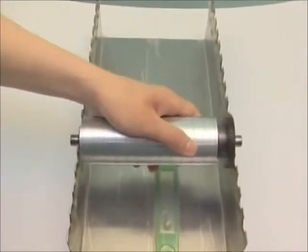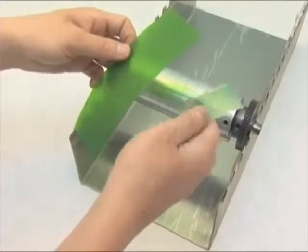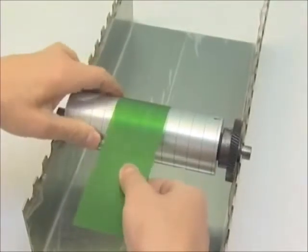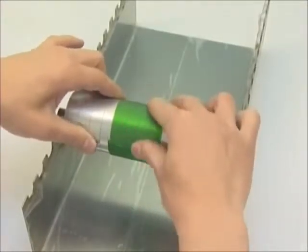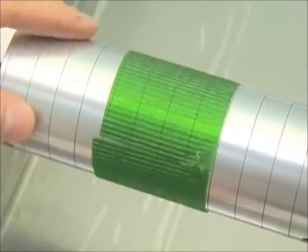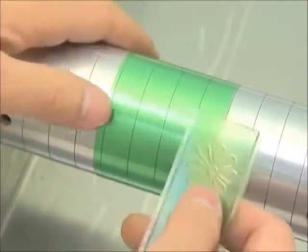After the installation of the printing cylinder is finished, put it on the printing cylinder container and then mount the double-sided adhesive tape on the printing cylinder. Cut a double-sided adhesive tape a little larger than the flexible printing plate and mount it on the printing cylinder. The tape should be drawn straight to ensure no bubbles are produced when mounting it. Rip off the protective paper of the double-sided tape after mounting it, and then mount the flexible printing plate on the tape.